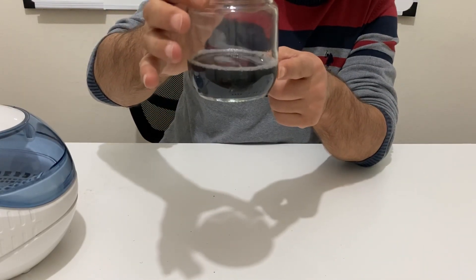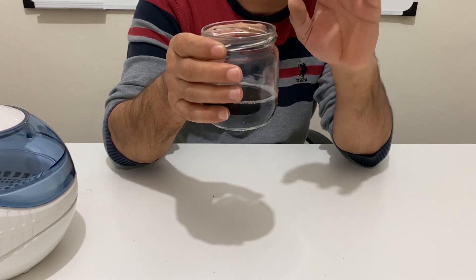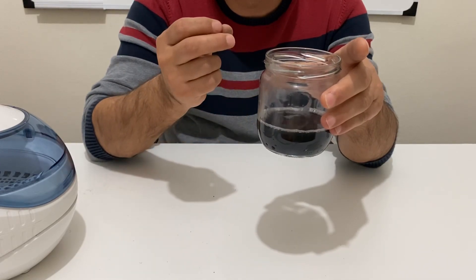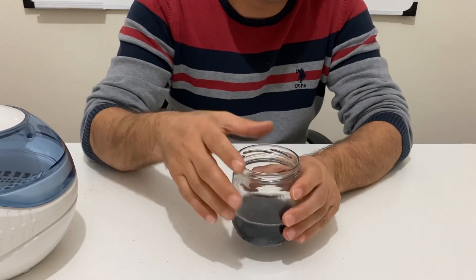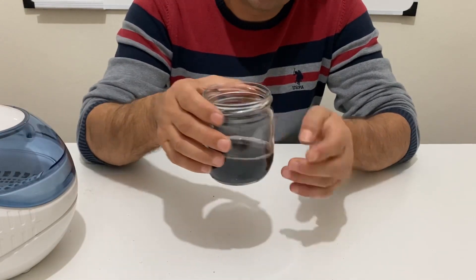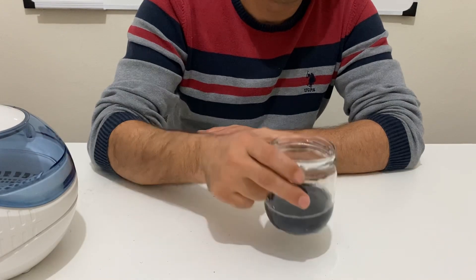After 24 hours you will get this graphene solution in water. If you let it dry you will get dry graphene, but my recommendation is: don't completely dry it. When it becomes a slurry, just take it and add some binder into the graphene, mix it very well, and you can apply this graphene to a surface for large surface area applications. I only sonicated for one or two hours, so if you sonicate for 24 hours you will get a better result — a very nice pure graphene.